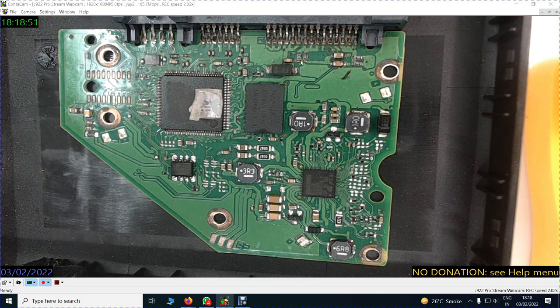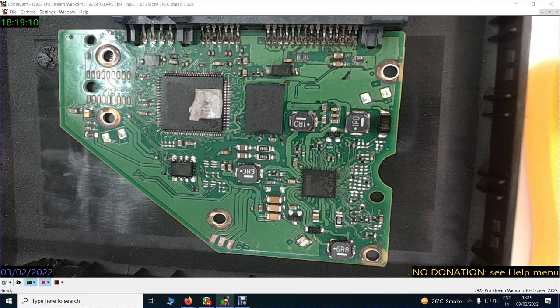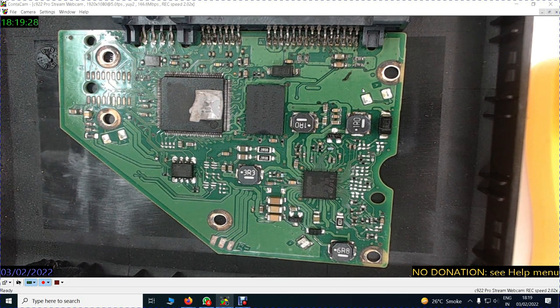So 5 volts from here through the condenser can go to other sections of the board. Again, if you see, if this is connected here through the condenser, that means the track running here is running through a diode. This is a diode. One side is positive and the other side is negative. Here is a line. The line end here resembles, it has to be positive, and this end has to be negative. Now, usually diodes also cause filtration and reduction of voltage depending upon the value of the diode.